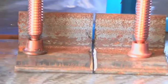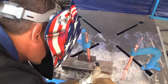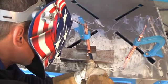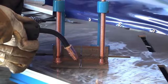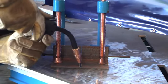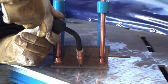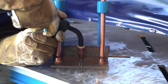In considering gun travel for MIG welding, the push technique is the most recommended and also gives you a good view of the weld puddle. For a typical butt weld or flat position weld, your gun should be at 90 degrees to your workpiece and 10 degrees tilted back, welding with a slight weave, pausing side to side to avoid undercut.